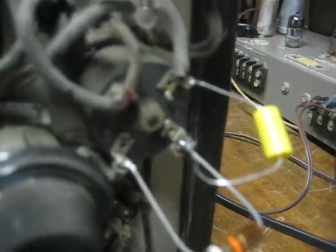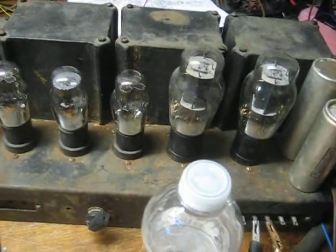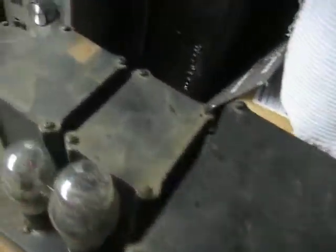So we kind of jumped it with some resistance, and we used a little capacitance from the hot side of the primary to the hot side of the secondary just to get some signal through it. It's probably nowhere near correct, but hey, it's working. Who else out there has a Western Electric 10A receiver with a monster 10, 12 watt amplifier? And this transformer is a beast. A beast. But that's the update.